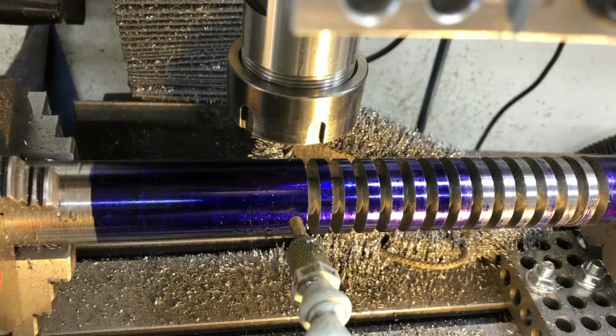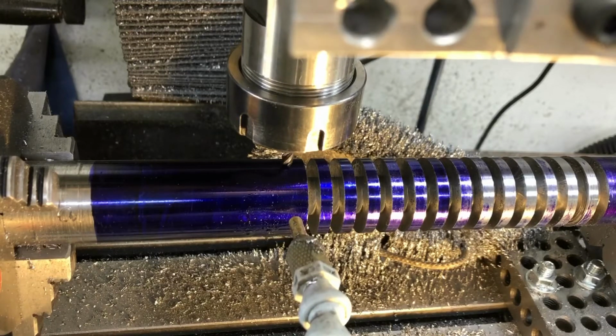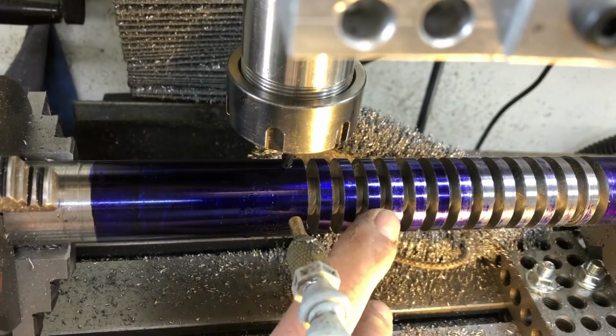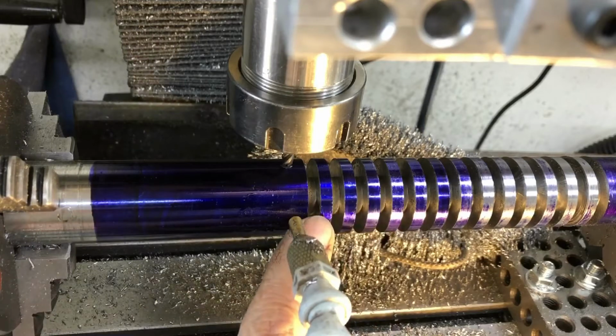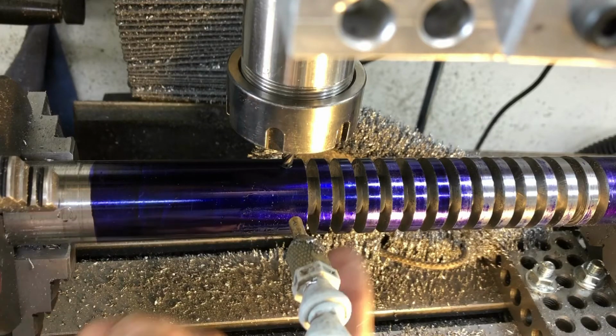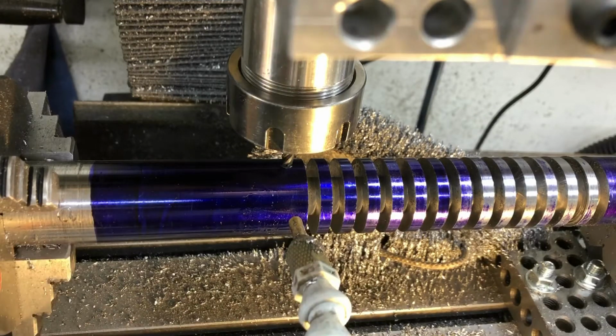So start out by coming down where it's right about to touch. All right. So that's about 848 on my readout. And that's because I'm going down, the bottom is 0. When I get down on the bottom, it's 0. So right now I'm at 8.5 millimeters from the end of this groove. So, in case you're interested.